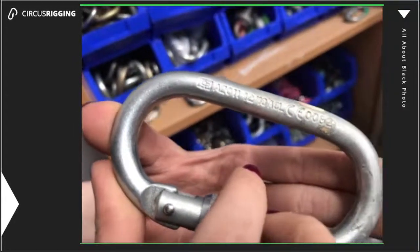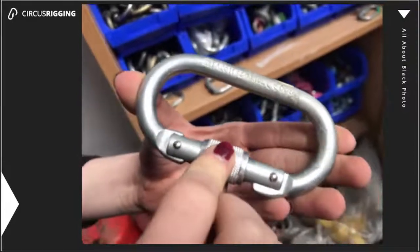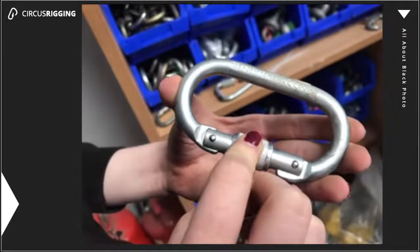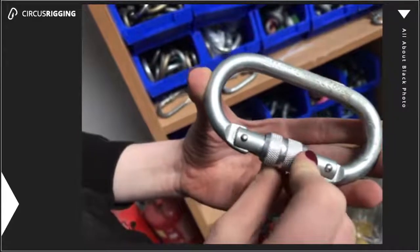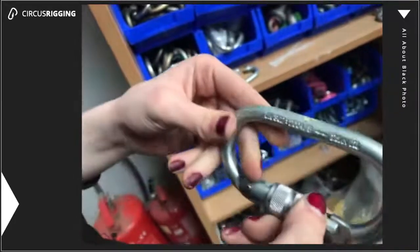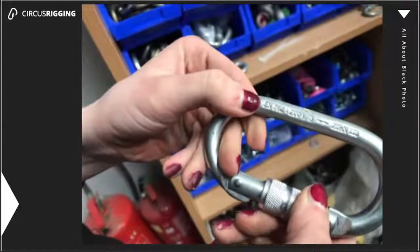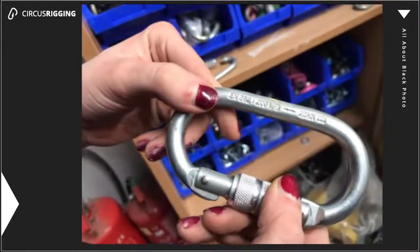0082. It is 82, is it? Right. So that's a company in France called Apave Sud. And they are what they used to call the notified body back in the CE days, pre-Brexit for us. On the other side, I noticed it said EN362, which is the standard that you must meet as a manufacturer if you're producing carabiners, or connectors, I should say, for use in a fall arrest system.